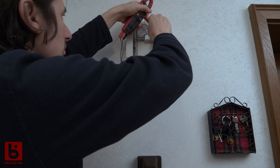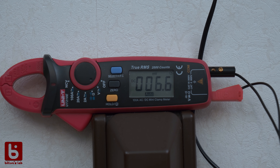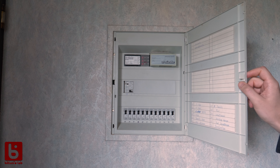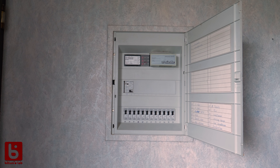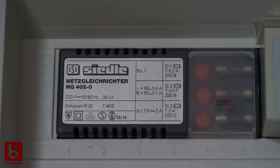This is a typical installation here in Europe. You can test it using a multimeter in DC and AC mode. The DC mode will only show the DC offset, while the AC mode will show 12V no matter which way you measure. This 12V transformer is usually placed in the breaker box, and sure enough, I found it there — it says 12V AC at 2A, which is good to know for us.